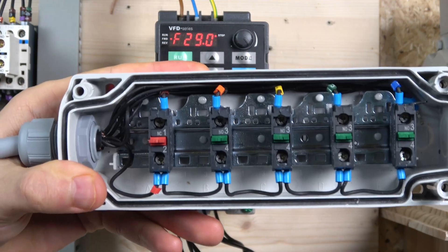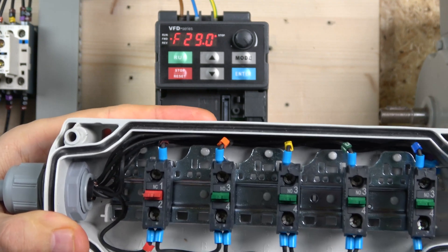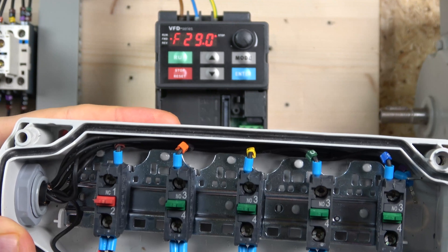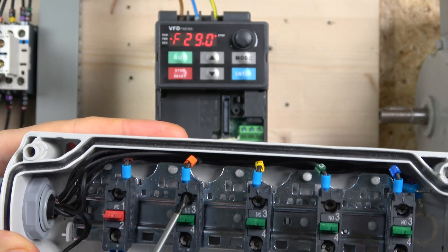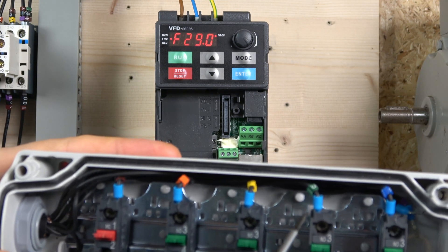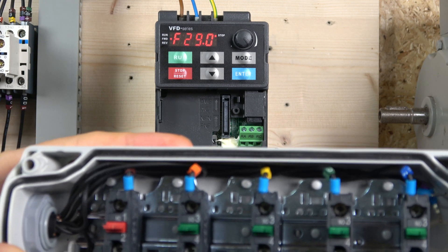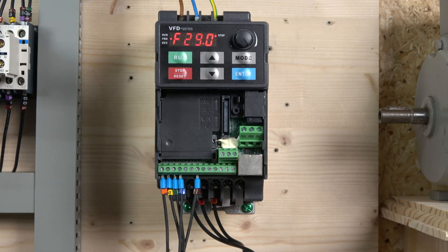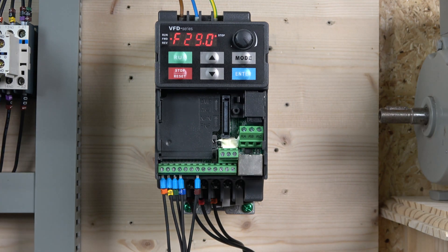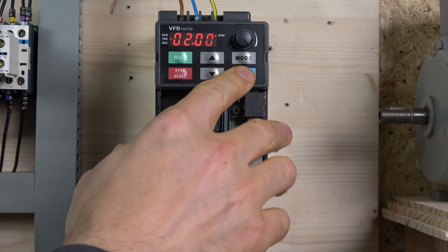The potentiometer is no longer there, so we have a very basic station. We have a DCM signal coming into the normally closed contact, which is our e-stop, and from there it carries on applying power to all the switches. M1 is run forward, M2 is run reverse, M3 is speed up, and M4 is speed down. It's quite straightforward, nothing too crazy, and this all connects in here correspondingly.